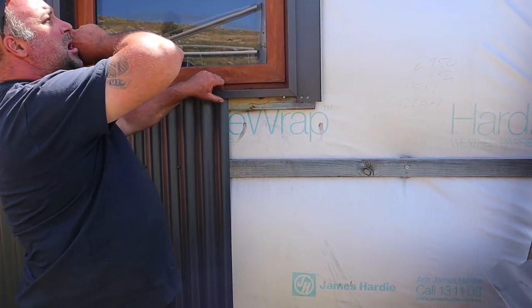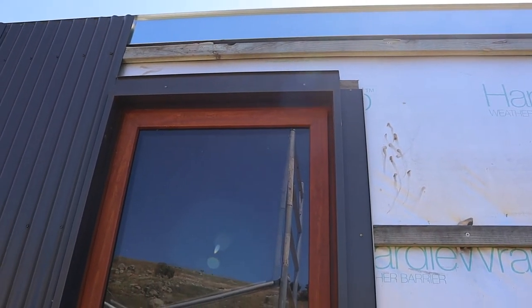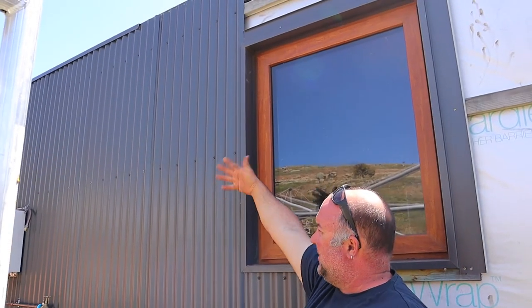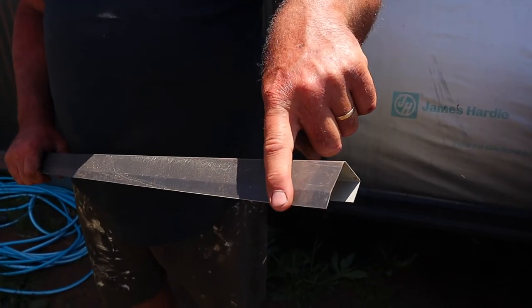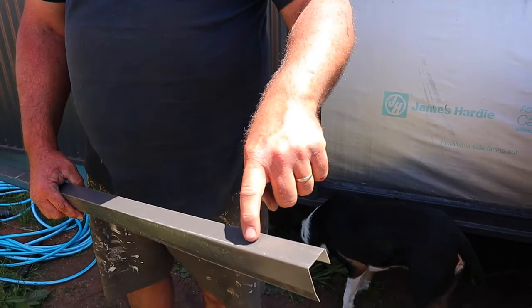As far as the top goes, you can see that galvanised pressing up top — that is actually our gutter. We wanted to have a hidden gutter. So you can see where we've started sheeting, how you can't see the gutter, which I think is a pretty good look. We just wanted that concealed type look. So the top flashing — this side actually comes over the colour bond sheets, and that just goes in behind the gutter and gets riveted down from the top, going all the way along. Hopefully that answers a few questions — feel free to ask as many as you like. Cheers folks, see ya.